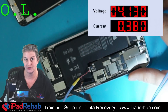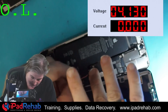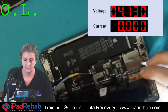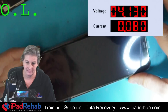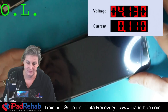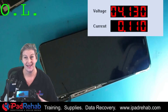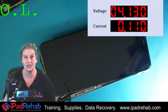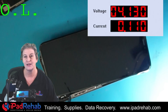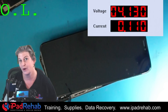So it should be making an image on the display. Let's go ahead and plug in our known good screen. With the screen on now, let's prompt it to boot again. It's different with a screen on — this phone hangs at a hundred milliamps. It looks like it can boot up except not when I have this screen plugged in. It's just chilling out at a hundred milliamps.